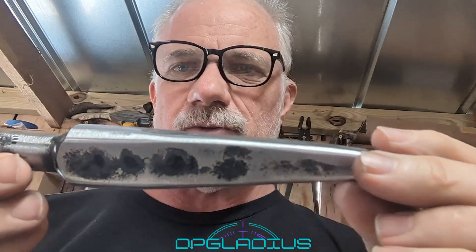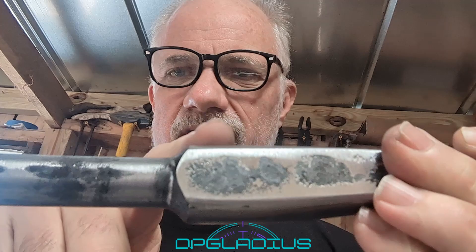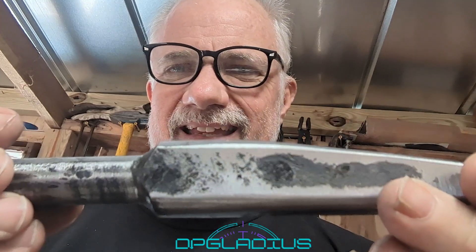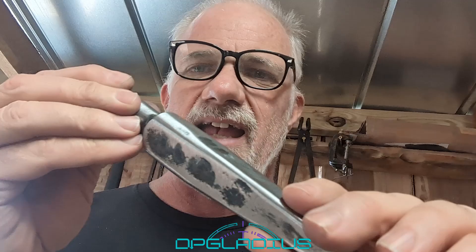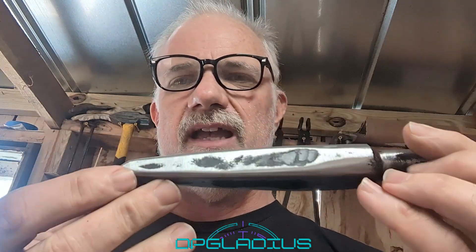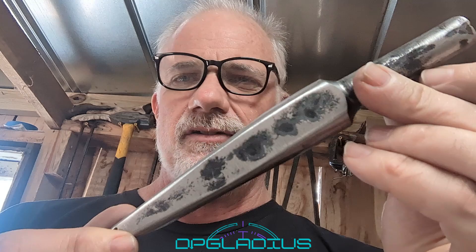All right, that'll about do it for the grinding. There are a few little scale marks on the side but I'm not going to worry too much about that. The part that's important is these radiuses here on the top — that's going to go inside the axe — and they both look pretty clean. The idea is to drift a small hole into the material and then drive this thing in until we get down to the flat spot. We have a pretty good little driving spike on the end, so we can hold on to that with some tongs. That's going to do it — we have a super nice axe hole handle drifting spike. All right, you guys get outside, do something fun, come back and tell me about it.